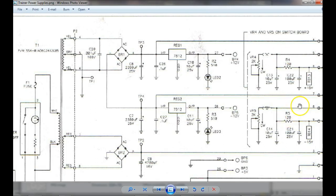Our unregulated has always got to be above the regulated. So, very easy. I check right here, I measure nothing. I check right here and I measure — you know, 14, minus 14, 15 volts — what would be the problem? It's real easy to troubleshoot. I got nothing here, I got something there. It's right here it's wrong. What would be the problem?